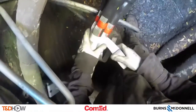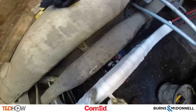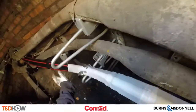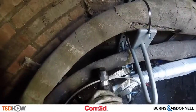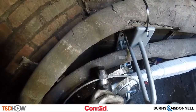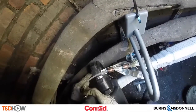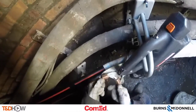Taping the ground braids in place here, and you'll see we use quite a bit of arc proofing tape to cover the entire cable assembly. You can see above this new splice the older graying lead paper splices that have been underground for a while. These are newer EPR insulated cables that are replacing those older splices. Here we see the attachment of the ground to perimeter ground using those braid tapes, and a series of ground connections using a press.